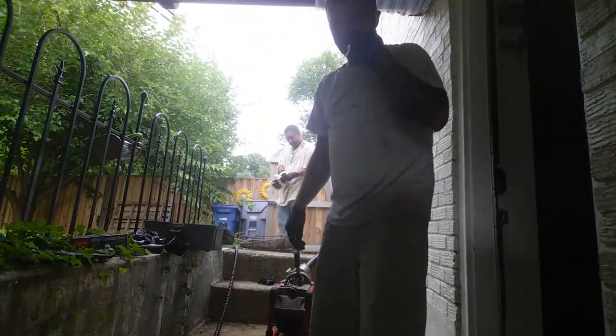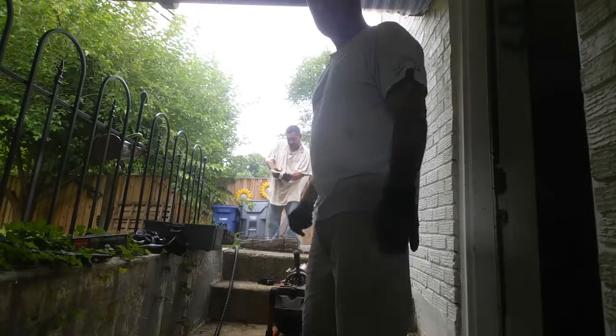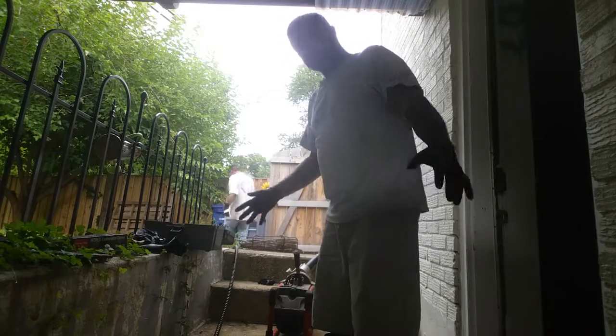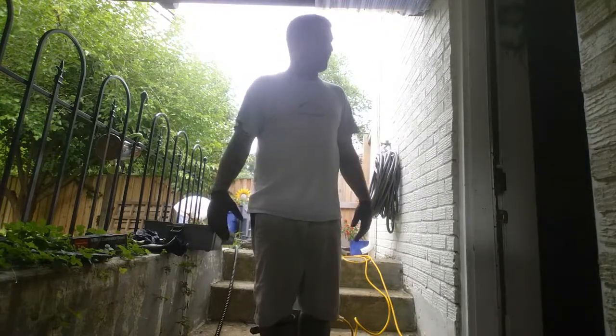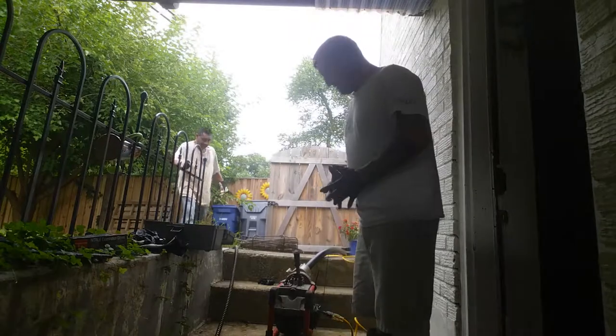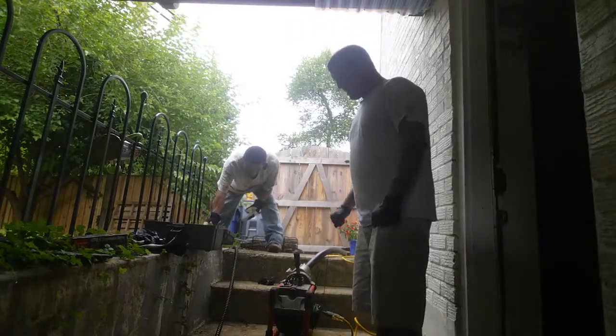Okay, first attempt with the 7/8 cable, we went two rods at 15 foot per rod, and we were unsuccessful. Now, we don't suspect this branch to be longer than 40 foot before it connects into the lateral associated with the rest of the plumbing for the house. So, at this time, we suspect that it's grease laden. We're gonna attempt again using the same method. See where that gets us.